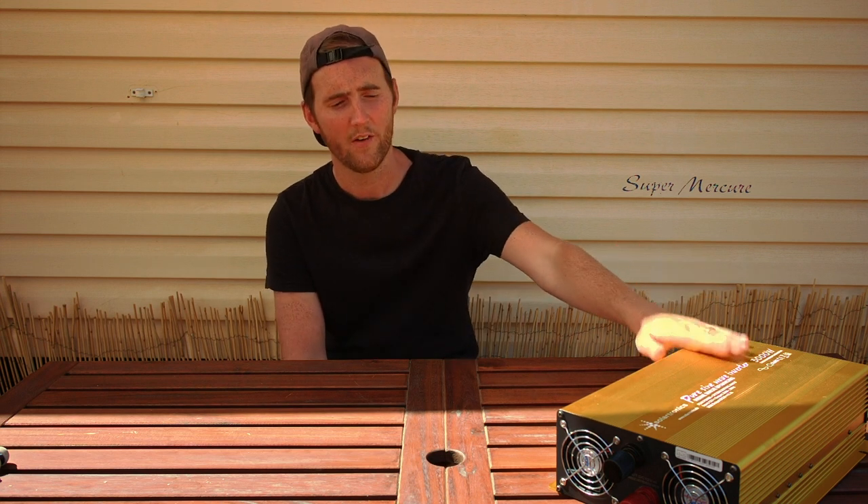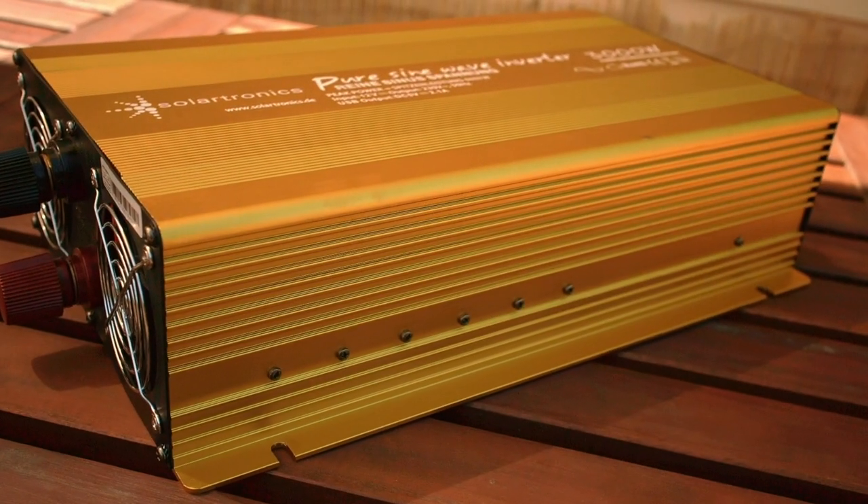After you have your batteries installed, you'll need to get your inverter. We have our inverter here — it's a 12 volt 3,000 watt continuous / 6,000 watt peak inverter. When you look at inverters you'll see those two numbers: the first, 3,000 watts, is how much it's rated for continuously; the second, 6,000 watts, is how much you can get at peak for a very short time. That's because most motors and heaters suck a lot of current when they start up. For us, the fridge is the big peak load, and Hannah's blender can take up to 2,000 watts on its highest setting, so we needed an inverter that could handle our load.